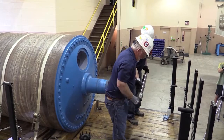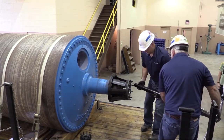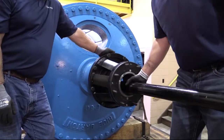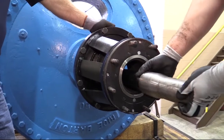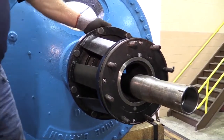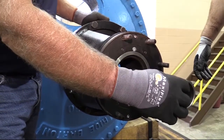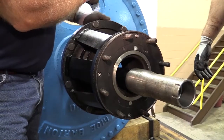Body and Support Tube. Note there are two different options for installing the support tube. Option 1: for installations where there is sufficient room between the end of the dryer journal and any obstructions, slide the tapered end of the support tube through the end cap assembly and into the journal, leaving approximately 12 inches protruding from the end cap assembly. The milled notch on the end of the support tube should be at the 12 o'clock position.